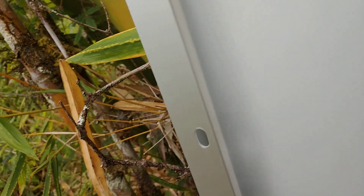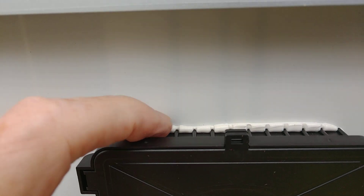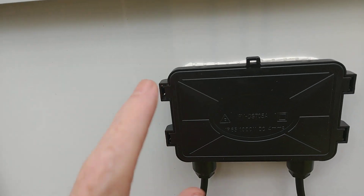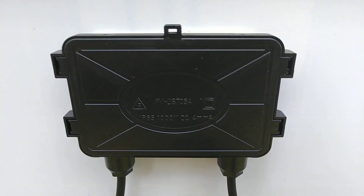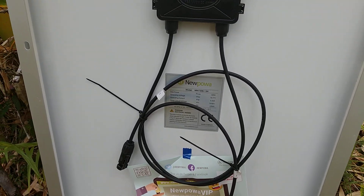There's a nice sealant bead going all the way around and that looks good. There's also sealant around the junction box, though it looks a little light on this one — probably could have gone with a heavier bead. It looks like they just ran a bead on the template and stuck it on. It's not extremely heavy but it looks to be completely tight. The other ones I've used had a little bit better sealing, but this one looks adequate.